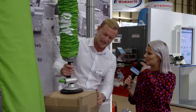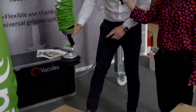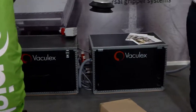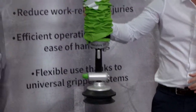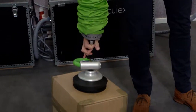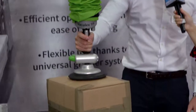I can hear it — is it a suction pad? How does it work? Basically, we've got an electric-driven pump, and you'll see the grey hose that goes into the top of the lift tube, and then we've got a manoeuvre handle, and whatever suction cup you use — we're basically just creating a vacuum inside this lift tube. So as you see when I squeeze in, it's just releasing the air out of the system. As soon as we touch the product and grip, as I start loosening it, it just creates the vacuum chamber, and away we go.